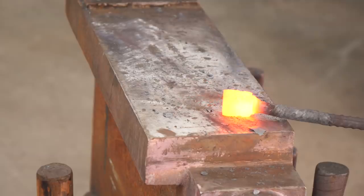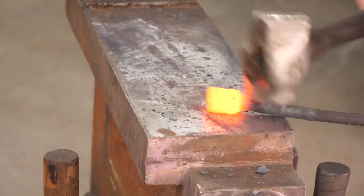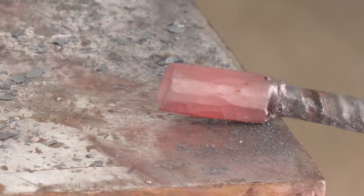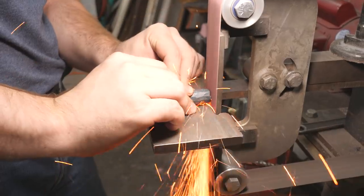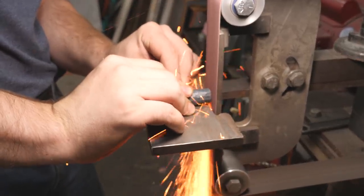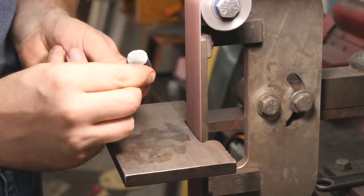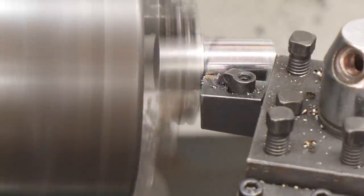While I'm waiting for the oven to cool down so we can temper the blades at 425 degrees, I'm going to go ahead and work on the pommel nut. I'm using a piece of W twist pattern Damascus and that'll go really well with the W feather pattern. Feather pattern doesn't make a very good pommel nut, and most of the time I don't have pieces of feather pattern the right size anyway. This will look really nice — especially from the end it'll have those nice W's on it and go really well with the feather.